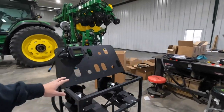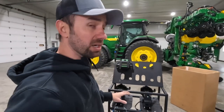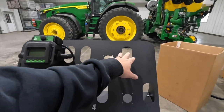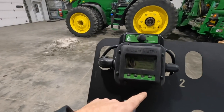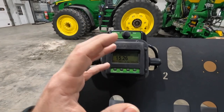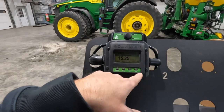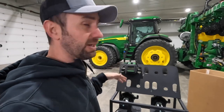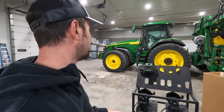In case you're wondering what this is in the background — this is an auto-batching system for our tender sprayer. How we're going to use it is it'll go on our spray tender trailer, and it's going to have three of these meters — we only needed three at this time. You can turn these on, and when you pull up ready to fill for your herbicide, you'll be able to type in how many gallons you need. When you're ready, you push start, and one or all three of these pumps will start pumping and counting down the amount of herbicide you need.